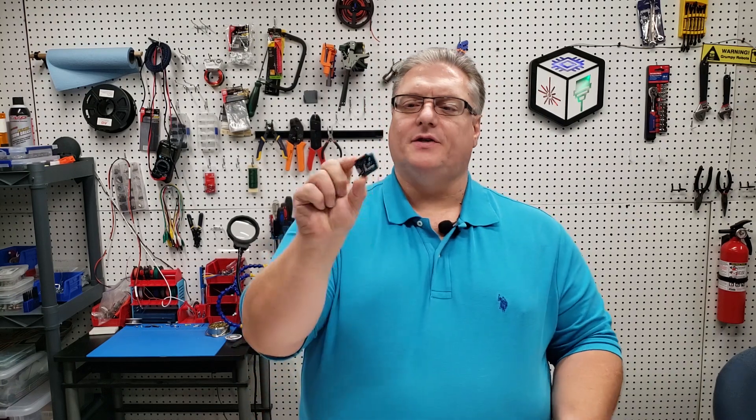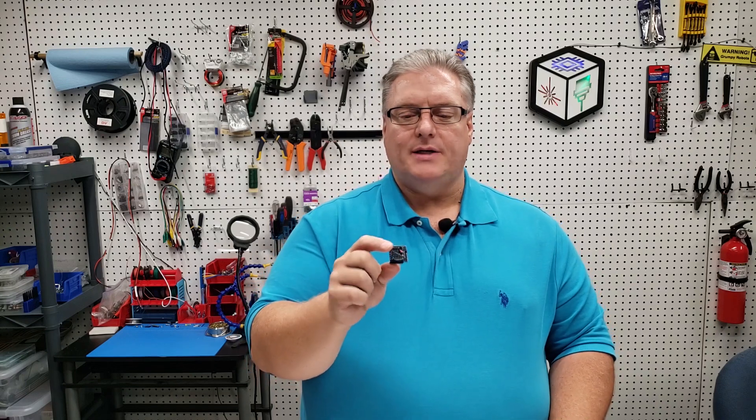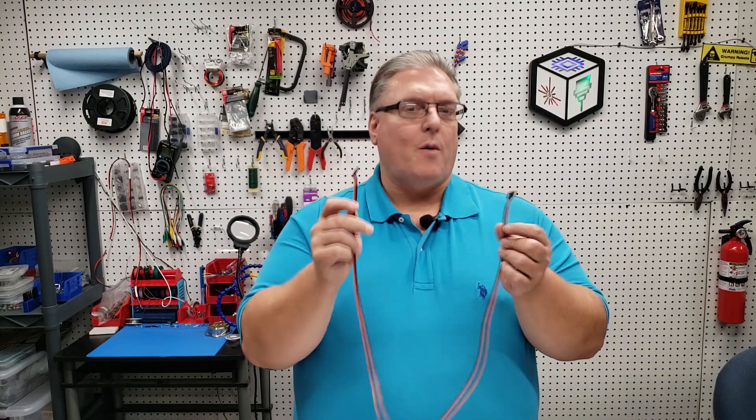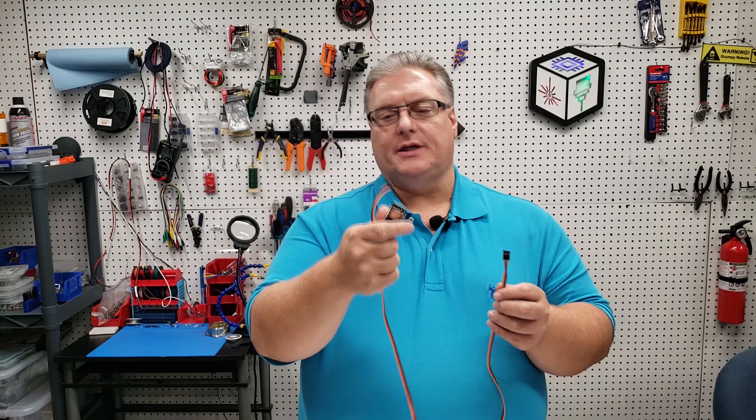To make all this work today, we need to do a few things. First, we'll solder some connectors onto this board, since these often come without connectors. Then we'll build a little breakout board — I have the link in the description. These breakout boards are handy for prototyping and fairly inexpensive. We'll also need one of these serial cables — four pins — for communicating between the SKR board and the ESP8266.